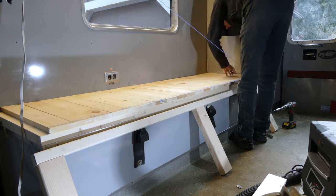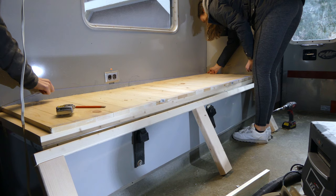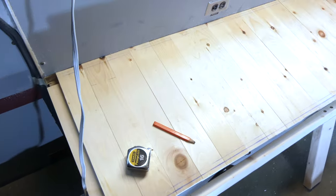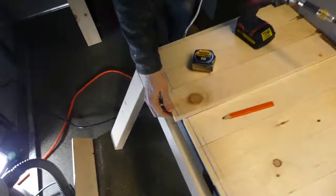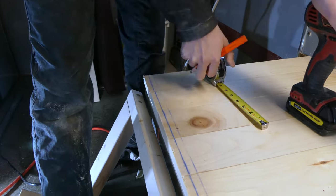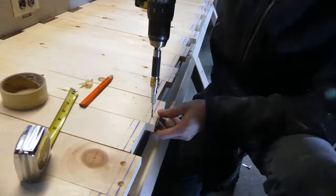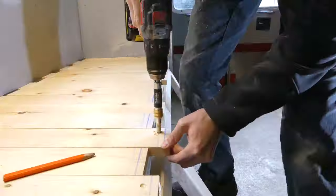Whitney - chalk lines are an amazing thing and very helpful for making something that will never be seen look beautiful, as you will see later in this video. Make sure you have all of the boards in an orientation that looks good - look for grain patterns, color, and knots that could get in the way of screws. I'm drilling two staggered countersunk holes in each board. This pattern will reduce the chance of the board splitting and it looks pretty cool.